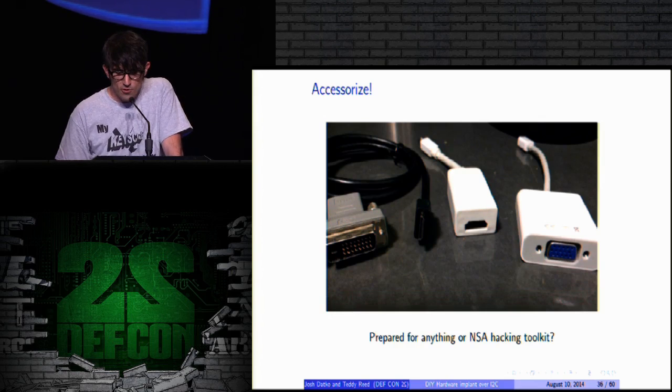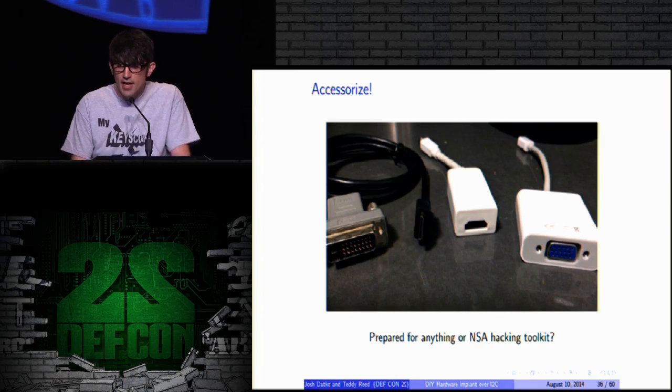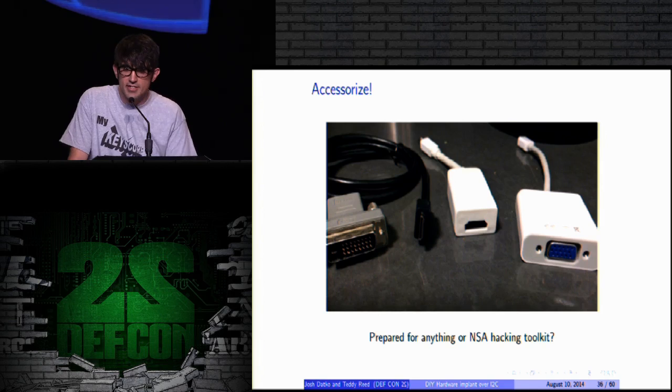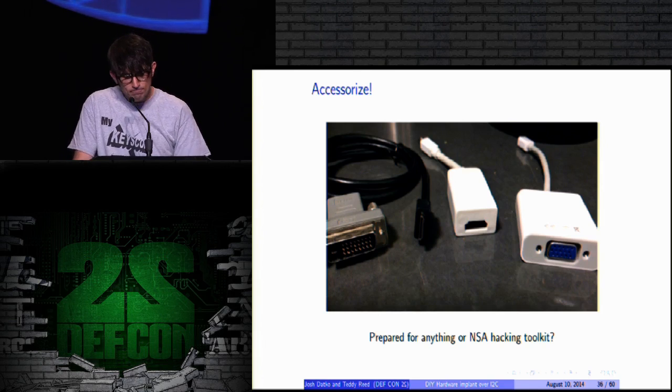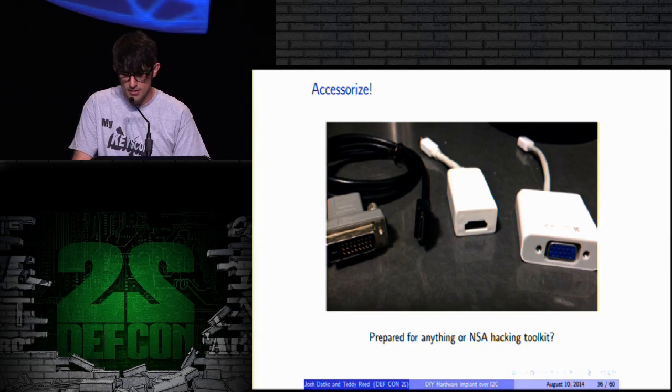And like we talked about before, this can work over multiple different monitor adapters. So if you get the CHUCKWAGON, you can put any kind of gender bender or HDMI, DVI. HDMI is actually probably a little better because there is this hot plug event. But yeah, you can put anything on there and get power from any kind of video adapter and have a bidirectional bus into a target.